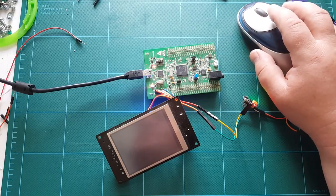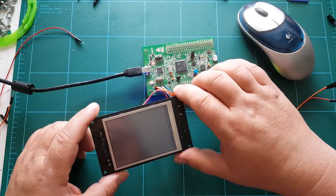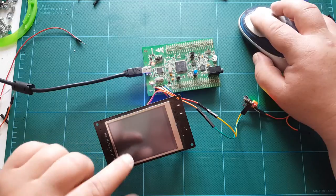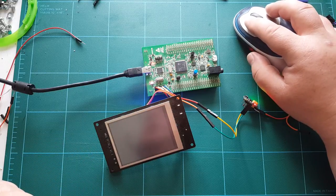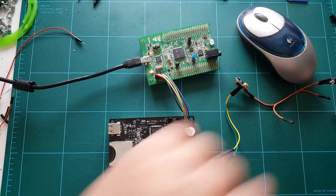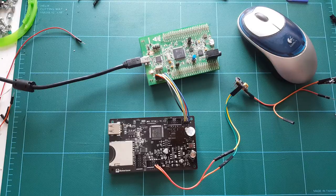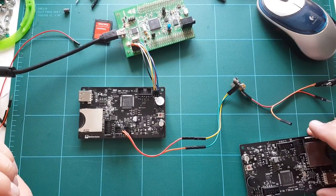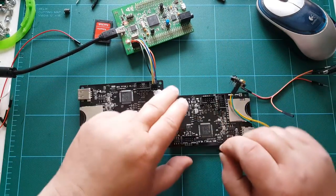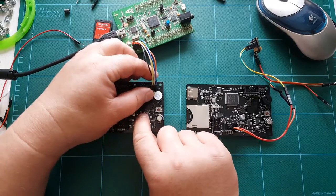What I'm going to have to do now is pull another display out of one of my printers - a working display - read the firmware off of that, and then burn it onto this one. Hopefully that will get it running. So I'm going to disconnect from this device, disconnect the power, take apart my printer to grab the working display. Here's a good display I just pulled out of my printer. I'm going to transfer the power supply connection and my JTAG connection.